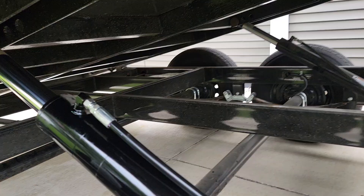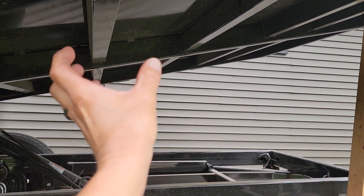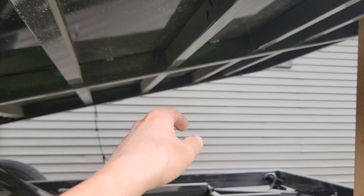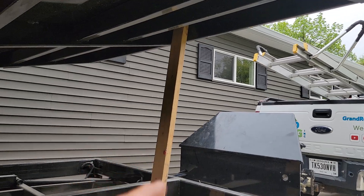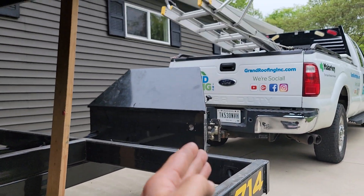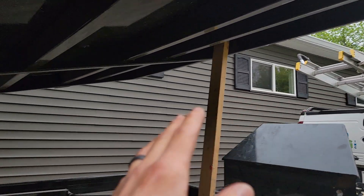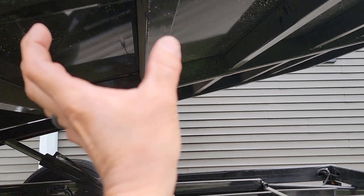It was probably five to ten minutes from setting up safely. I had a second safety stand, and the reason being — when I let it down to take the weight off, this side continued to come down and put me in a bit of a bind. I had to get my floor jack out and raise this corner up to take the strain off it. So when you bring your safety jack up, lower your trailer down so it comes up to it, but don't put a lot of weight on it.